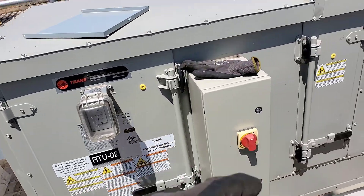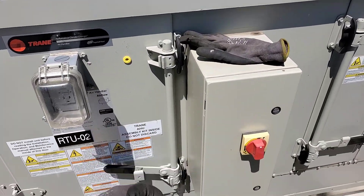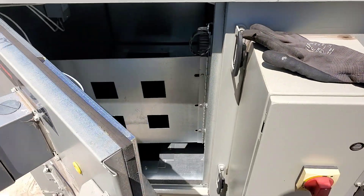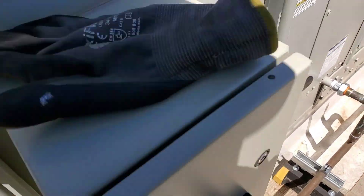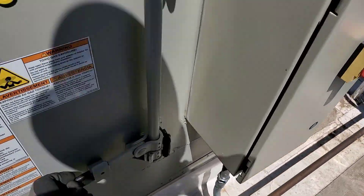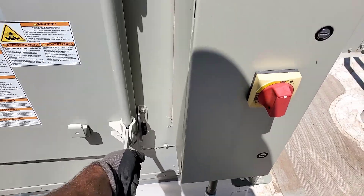I disabled this one down at the condenser - first stage worked out okay. With first stage disabled, you can notice the fan has ramped up to kick-ass mode. She's hauling now. Opening this up - it's got negative pressure now.